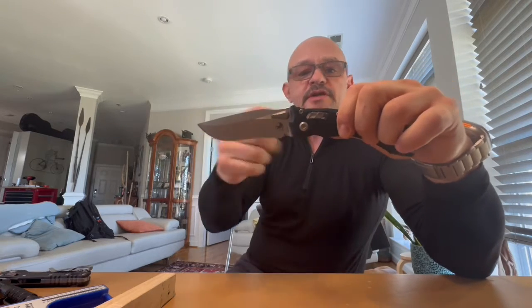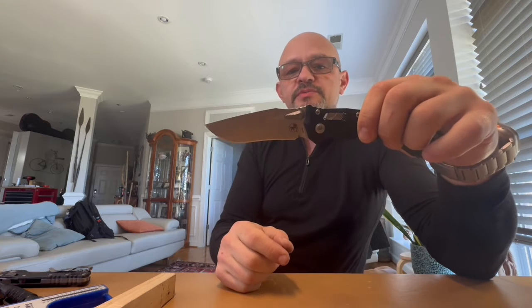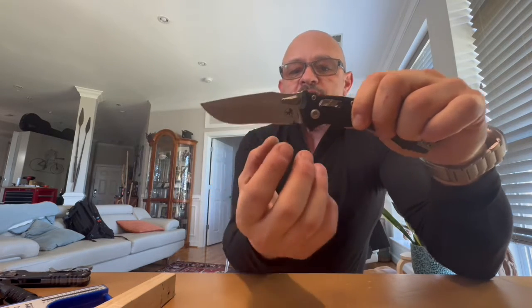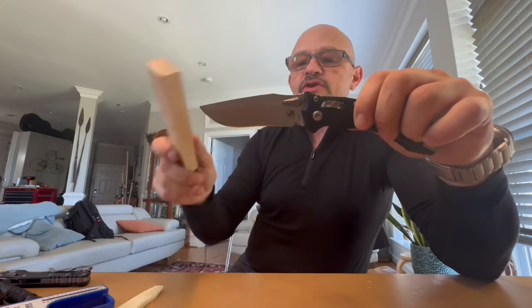The reason you can hang much higher weight on the end of the blade and it will do absolutely nothing to unlock it is because it's considered to be a static situation. So statically, when you apply that much pressure, things start happening on the material science level, where compressions and frictions come into play, and basically the mechanism statically locks itself. But when you do a dynamic wrap like this, you are dealing with a totally different area of the engineering side.